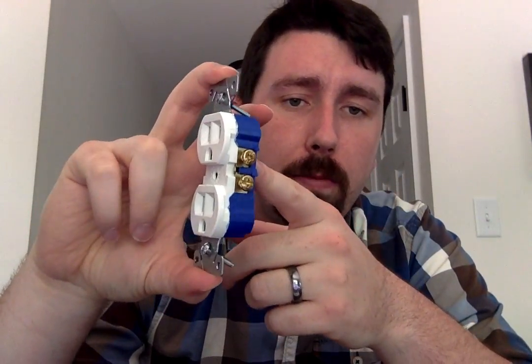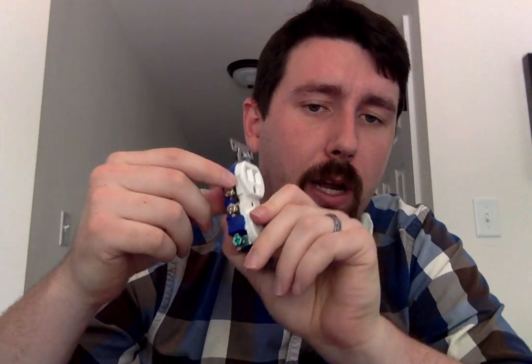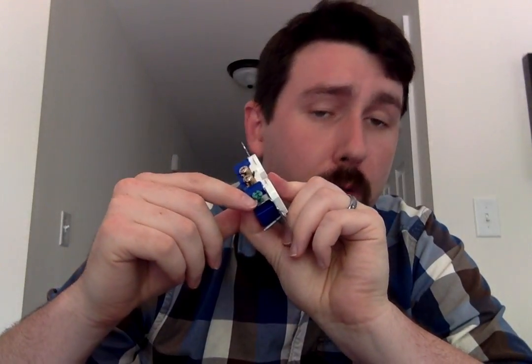You're going to see at that point — we're going to go with the three-wire one, there are five-wire ones but I'm explaining the three right now — you're going to have a black wire going to your gold, you're going to have a white wire going to your silver, and then you're going to have a green wire or an uncovered wire, depending on how old the house is, or maybe no wire at all. If it's that old, it's the ground wire going right here. You're going to turn it left to back the screw out away from it, and then pull the wire off. You may need needle nose pliers depending on how hard it is to pull that off. Do the same thing for the silver — take the white wire off — and the same thing for the green.